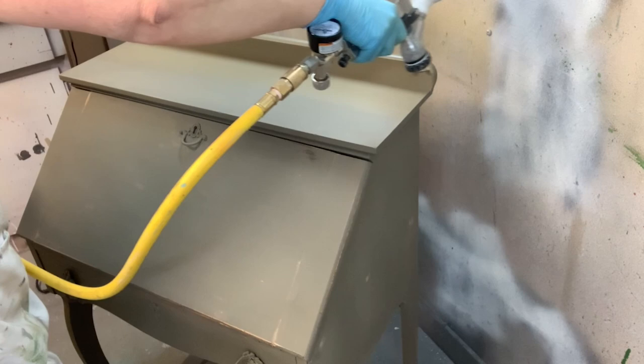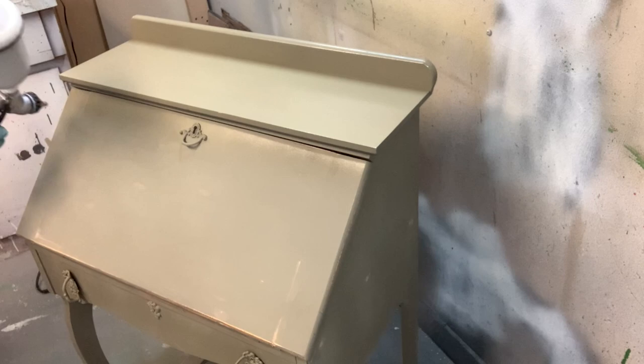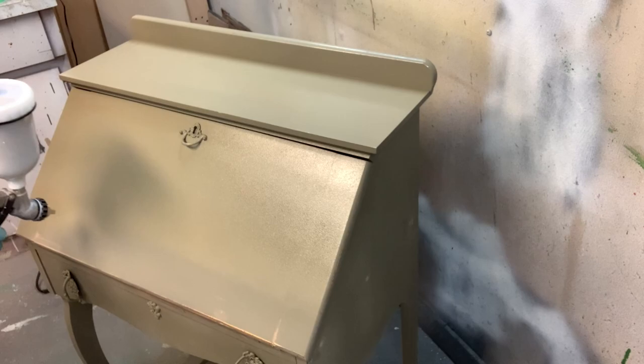You don't want to spray or brush on your first coat and then, as soon as it's dry to the touch, go on and do the second. Ideally I like leaving it for four hours or sometimes even overnight, and then I'll apply a second coat. And you'll notice with the second coat, nothing is showing through — no more bleed through, no more splotchiness. The second coat covers everything up perfectly and beautifully.